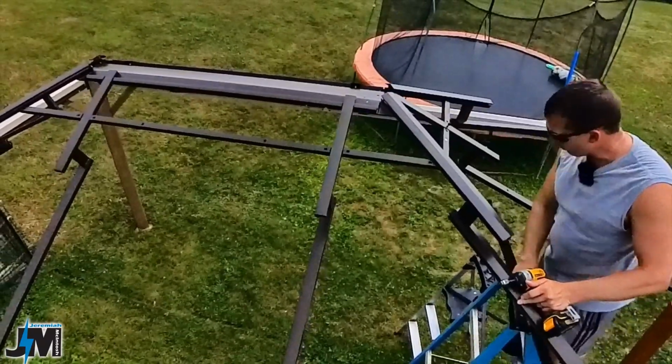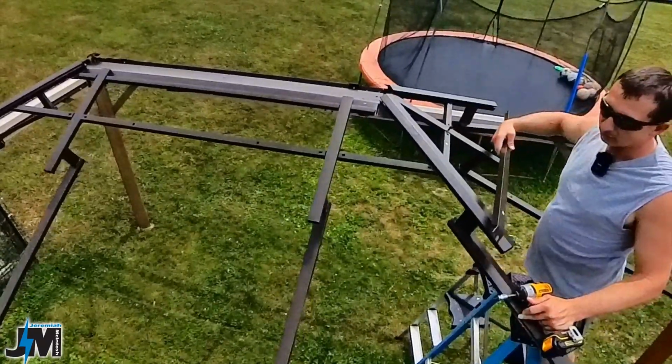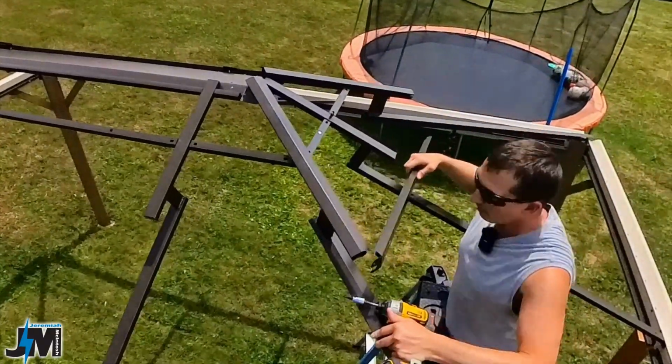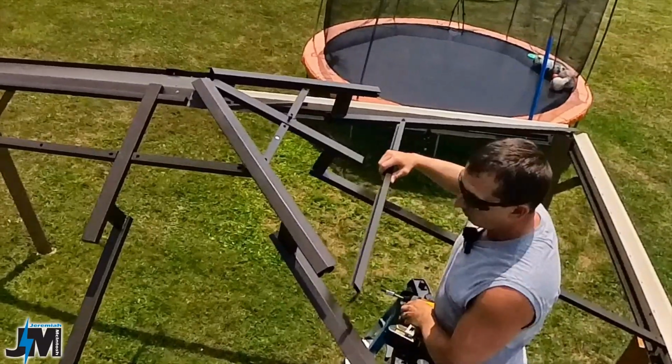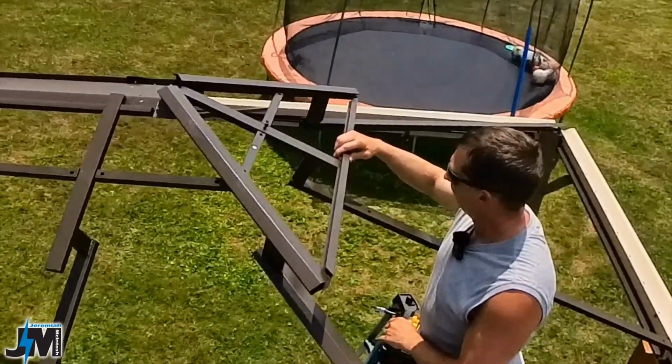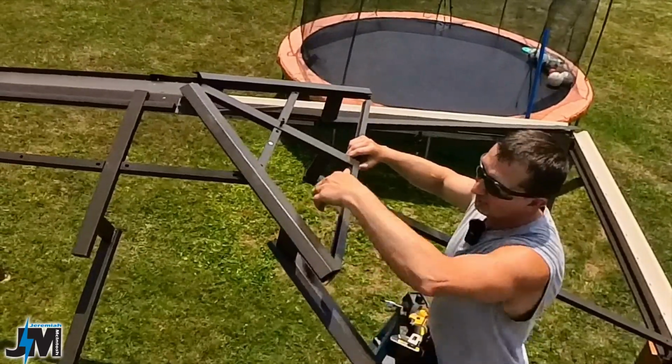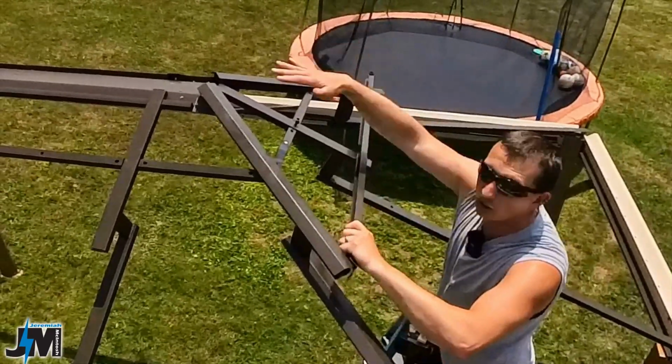But now I'm on this step where you install the outside rails of the top part of the roof on this tiered roof system here. I'm on the G5 piece, and this goes on here like this, and then you have your little corner pieces that go over here, and then your sheeting will slide down into this, and then you install your top cap